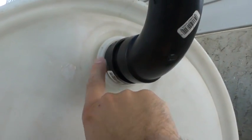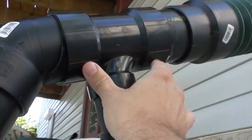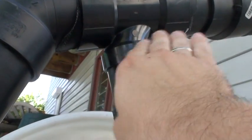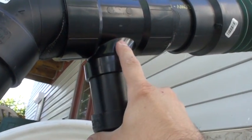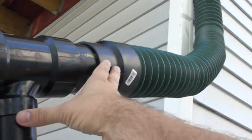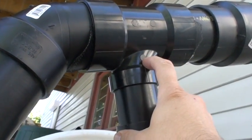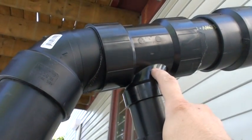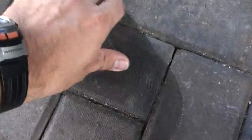This is a union — it's threaded on one end, two-inch thread, and plain on the other. There's also a screen, which is very important. It's sandwiched in at the bottom of the T fitting, so anything that goes through here has to go through the screen. If anything gets stuck in the screen, a good flow of rain would wash it out, and I don't have to take it apart to clean it — though it would be easy since it's not glued. Here's the part of the flex spout I cut off; it fits into the four-inch piping perfectly. The screen is just a cut piece placed in the bottom of that T.